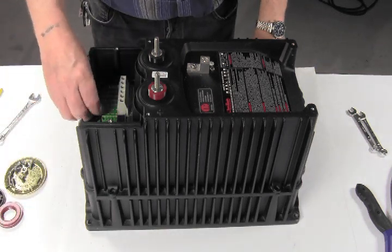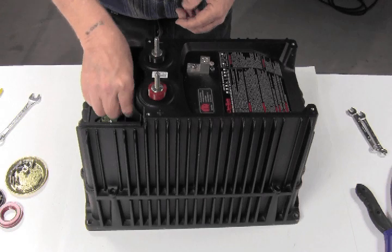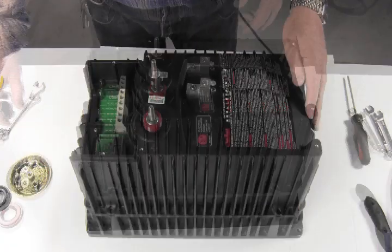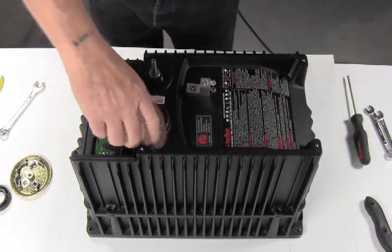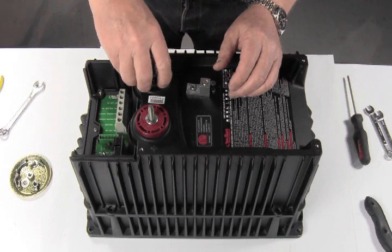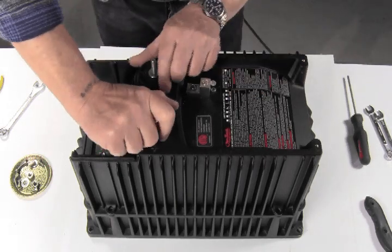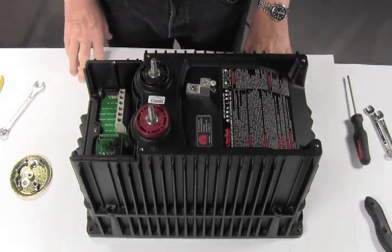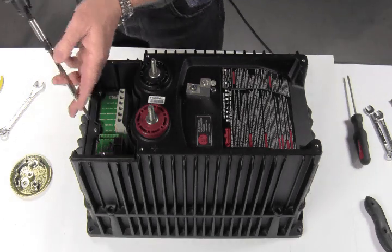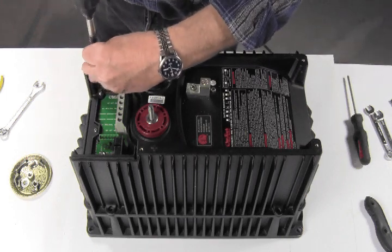Next, we put in the six screws — just placing them in right now, not screwing them in yet. Sometimes it helps to push the gasket towards the chassis, because the gasket is made slightly smaller. Next, take the battery terminal nuts and screw them on. This will bring the chassis all the way down onto the FET board, and when fully tightened should bring the top chassis all the way down to the lower chassis. Be sure to check this, and if there is a significant gap, there could be something stuck between the two. Then tighten down the six screws connecting the chassis to the AC board. If you don't have a torque setting on your screwdriver, just screw them so they are secure — nothing too tight to the point you strip the screws.